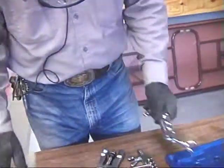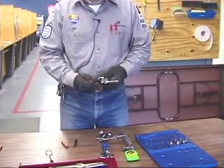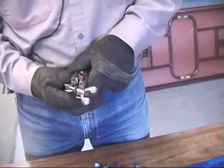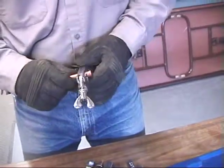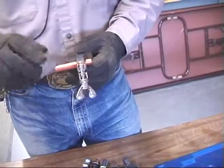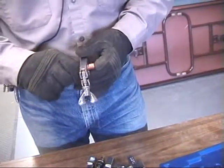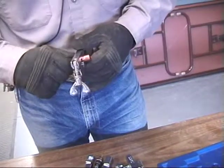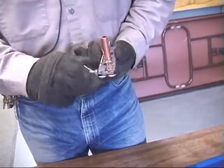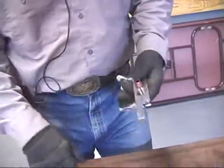Now we're set up and ready to go. Put your gloves on, put your glasses on, and we're ready to go. Rotate the vise over so that you have the flat surface for your copper tubing. What the books say is, whatever the diameter of your tubing is — in this case half inch — you raise it up above the flat steel clamp one half inch plus one sixteenth of an inch. Just rotate it until you eyeball it; you don't have to use a tape measure, it isn't that scientific. Lock down your vise using your fingers only — do not use a tool.